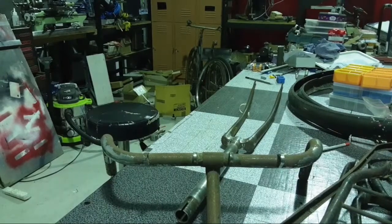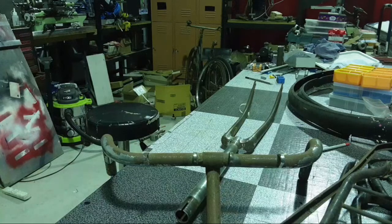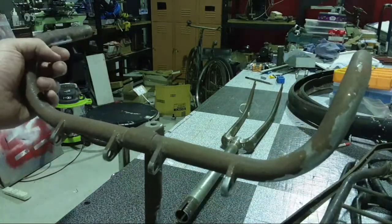Well, that's a thought too, but the money is not in the nickel plating. If it's ready to nickel plate, it's not a particularly expensive thing. The money is in getting it ready to nickel plate, which is the expensive thing. Stripping it and bead blasting it, and then maybe filling the holes and straightening the pipes out and things is probably something I can do. And then nickel plating is not particularly expensive, but most of the work in this is in filling up the flat spots and making it so the plate's nice. Don't have a press, and no one has room for a bead blaster. They're messy, rotten things. But I'm sure there's someone around here in the Marine Precinct who has one. They'd like a couple of cartons of beer, but we'll see how we go with that.